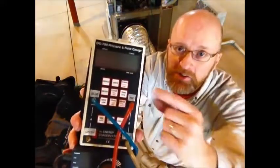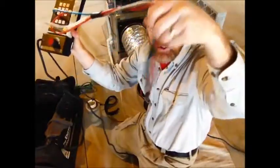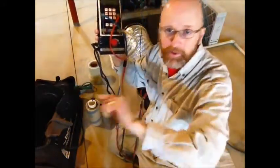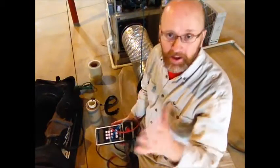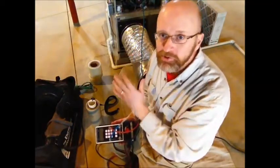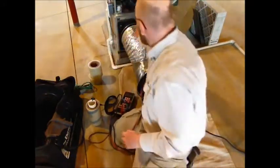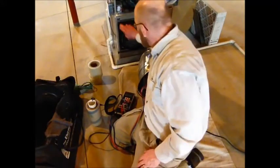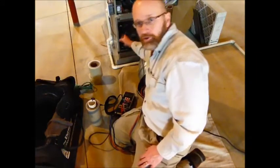You can also see that I have my gauge labeled with the different colors of tubing that I'm going to use. I have my tubing taped so that all three tubes go together as one, and the end of it — the blue tube — is a little bit separate because that I put in the plenum. I'm testing at the air handler instead of at a return register because I get the best results by depressurizing the system and testing from the air handler. I also have a plexiglass transition piece on the air handler that I've attached my round transition piece — the one the duct blaster came with — to.